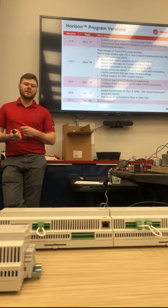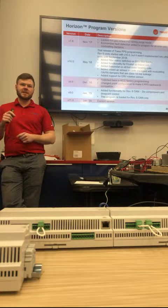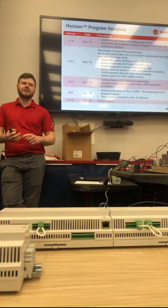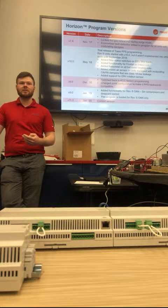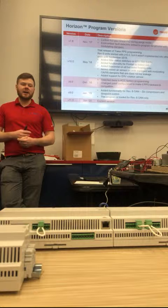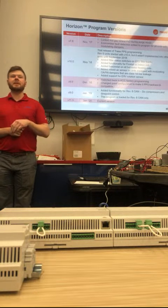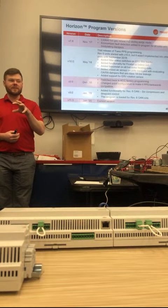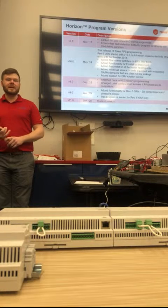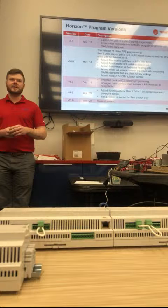What we used it for was the PPS configurator, which builds programs that are specific to each one of the units. So it only had TGPs and points that were used on that unit. It looked at the model number and put together what was needed. So there were only a few points used in PPS programs that weren't used in the units. For the most part, if you see a PPS program in a unit at 10.0, then it only has the programs that are used for that. Those options are in there.